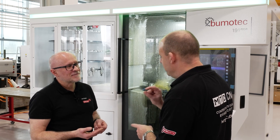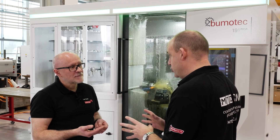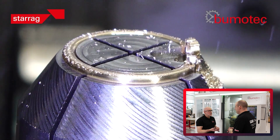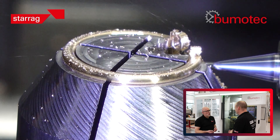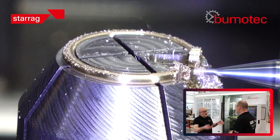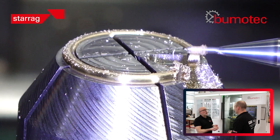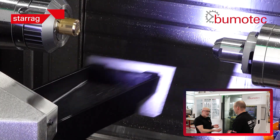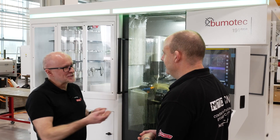There's no polishing on these — they come off the machine finished. There may be some light polishing after the stones have been set, but they're a finished product off the machine. How do you handle the swarf? Well, we don't have a swarf conveyor — what we have is a chute system into a tray. The swarf goes through a polymer filter, and the polymer filters are changed for the different metallic types, into a tray that's pulled out. The swarf is then collected carefully, because the swarf is as valuable as the ring.